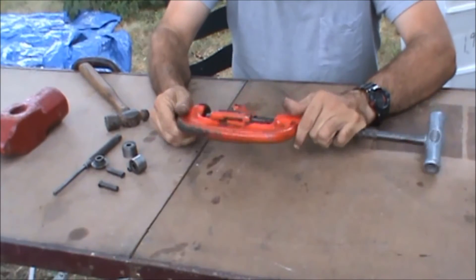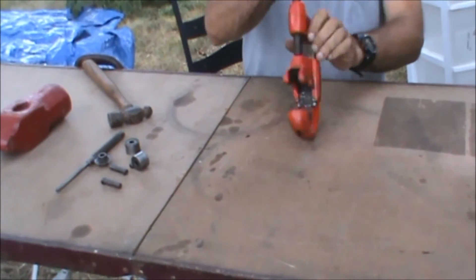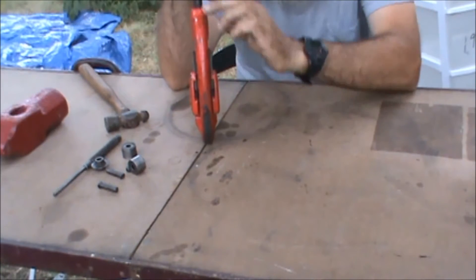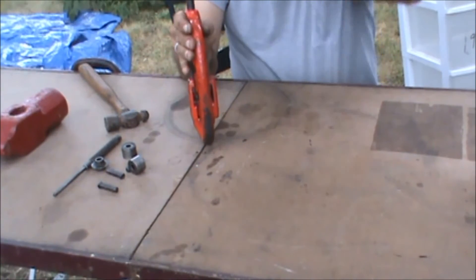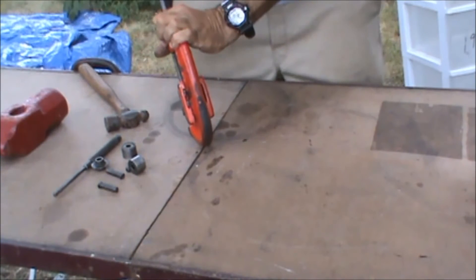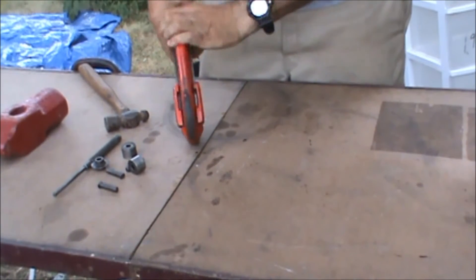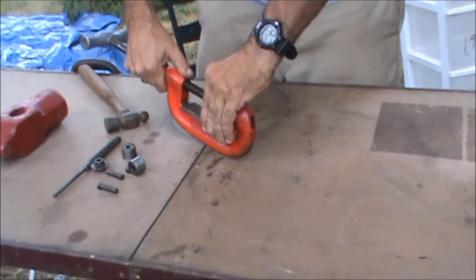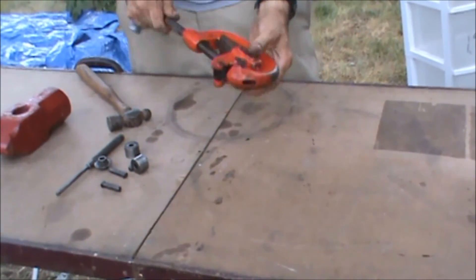Now, if you want to take this apart further, on the back here there's a slot on each side of this jaw. What you do is screw the jaw in like you're going to close it. Don't try and do this before you take all this stuff off — it won't close right and you'll have a problem. You might also want to put a little bit of lubricant, some WD-40 or light machine oil, on that screw lead. Just keep screwing that in until all these slots line up — it's almost completely closed when you do that. When you get it lined up about right, it'll literally fall down, and you can turn the jaw back and forth a few times and it'll fall the rest of the way out.